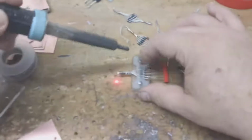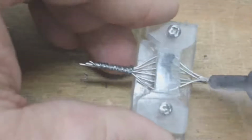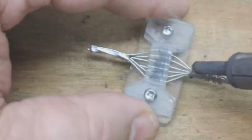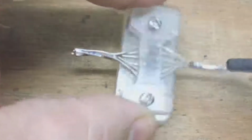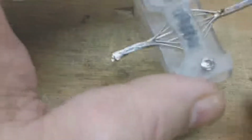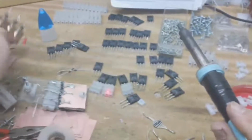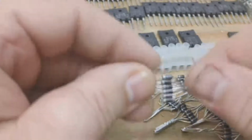And then when you take your soldering gun, you're just heating this up, and you're able to just go straight down like that and come up with a nice even flow of the solder. And then you do that on the other side and you end up with this. And this is the way I'm doing all these now. It makes it easier when you go to solder these on. They're not sticking up, similar to these. This is a real pain to solder down. This was a breeze.